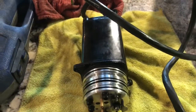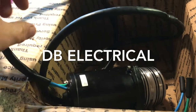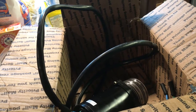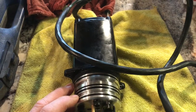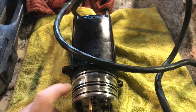Today I have a three-wire tilt-trim motor that stopped working, and I'm going to dismantle it to see what caused it. I also purchased another one, which is a two-wire — DB Electronics — and it's supposed to be the direct replacement that comes with relays. The initial one has solenoids, the new one has relays. I hooked that up and it also failed; the motor ended up getting hot and the relays got hot. So I'm wondering if it's the motor itself or something in the electrical on the 35-horse.